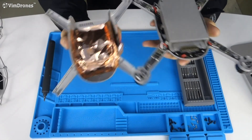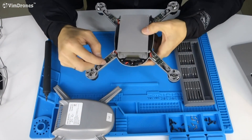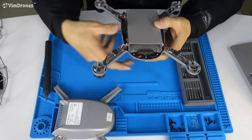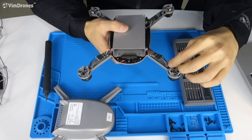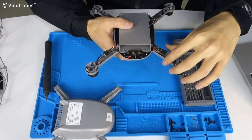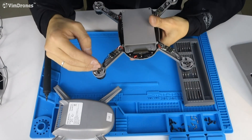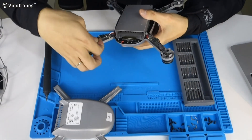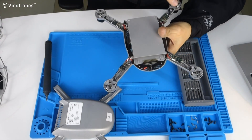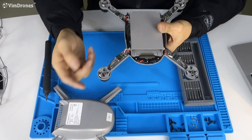We need to be careful — there is a cable connected to the GPS, so we need to unlock this cable so we can remove the top case. Inside the drone we need to unsolder the ESC pads. One important thing is to take note of the order of the cables connected to the pads. In the left arm the order is interlocked, and in the right arm the pads and cables are in order.